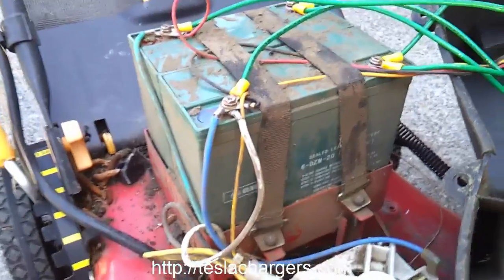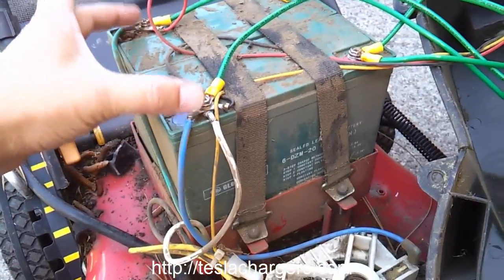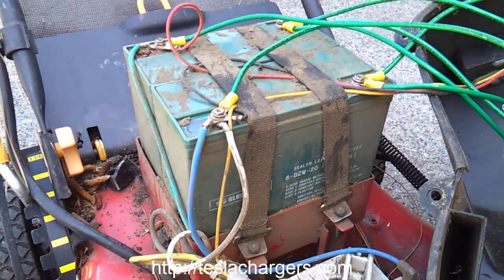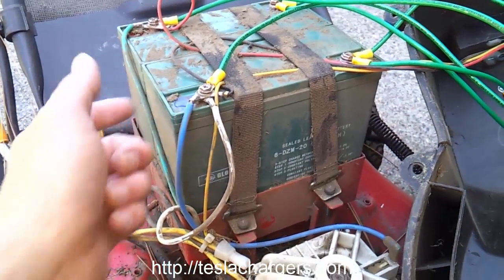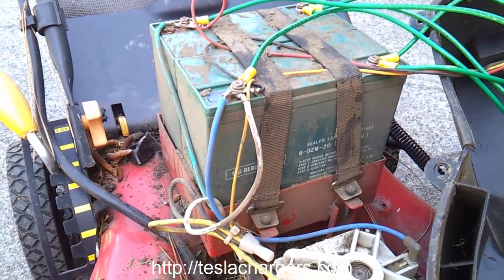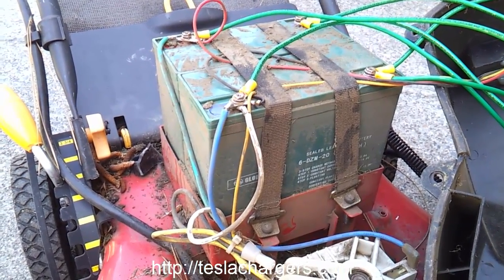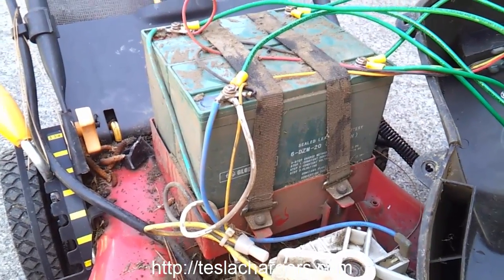How I have been charging this: with the batteries in series, the 24 volt output goes to the motor, and I just had wires coming out and I would charge it with my 1AU universal charger on the highest 24 volt setting. It did pretty good and actually outperformed the factory charger — I wound up with probably about 50% more capacity. At the other house I had, I was able to mow the entire lawn on one charge with the 1AU, but with the factory charger, I was only able to mow the front and maybe about one third of the back before the red light came on.